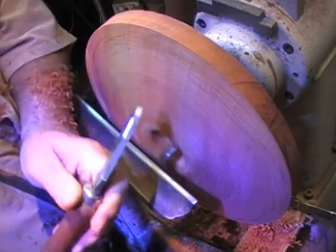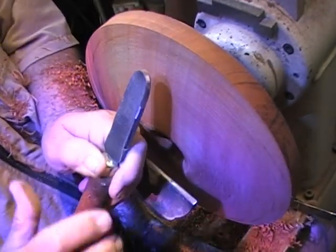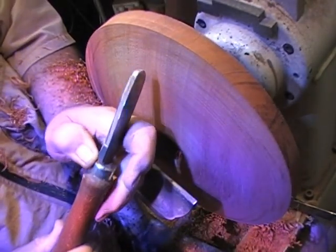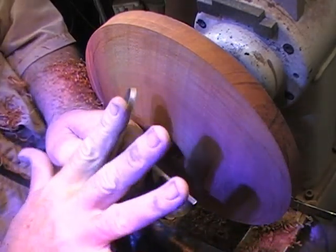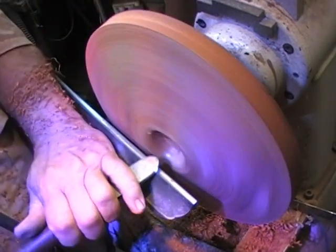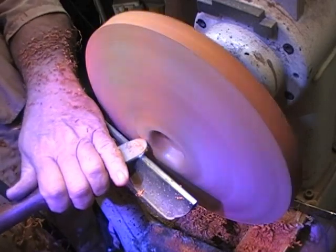Do you know how many times you overlook this to be the fault of a bad cut? Really. This could have junk, gook, glue, paint, finish, varnish, a nick, whatever. And I keep mine smooth so they move nicer across the tool rest. We have this scraper, and we're going to go inside for a light cut. And then we're going to easily pull it along.